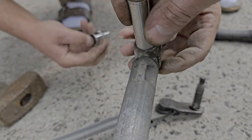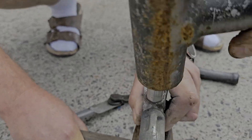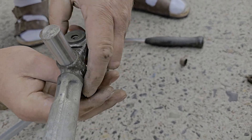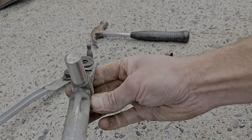New bearings have no gap, just small grease grooves. We placed the part on a big hammer and socket key matching the diameter of the part so that the bearings can fall into. First one is out. I wouldn't advise squeezing this part or mounting the end of it in a vise because it might crack or break. Now the second bearing is out as well.